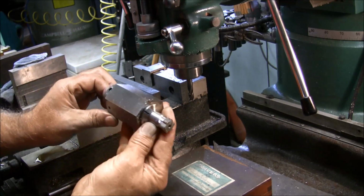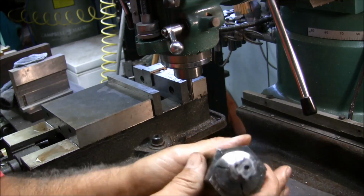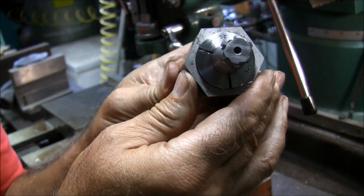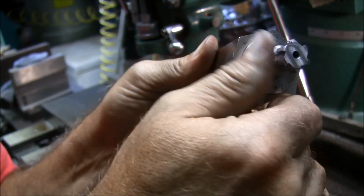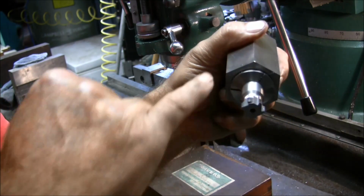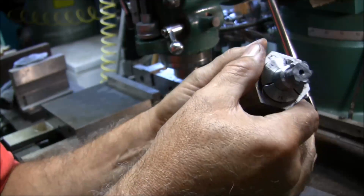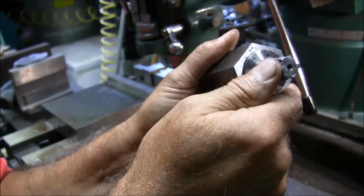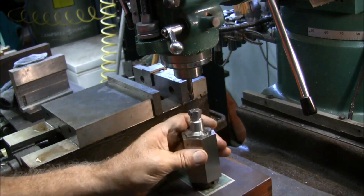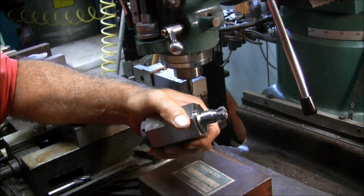Okay. Hey, that looks pretty good. What do you think? I think that'll work. You know, really cutting in brass, it may even work without putting in secondary and primary reliefs on it. I'm gonna have to sit down and deburr it all, but that's okay. To me, that's looking pretty good. I'm gonna call that good, and I think I will grind it after heat treat.